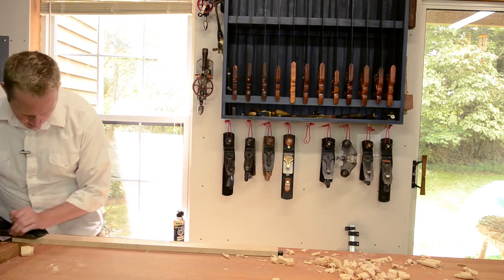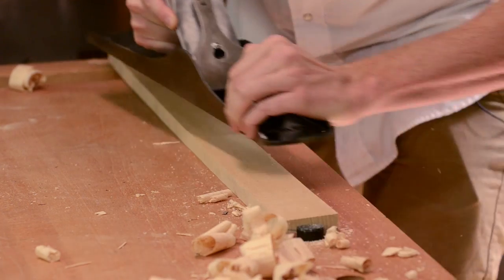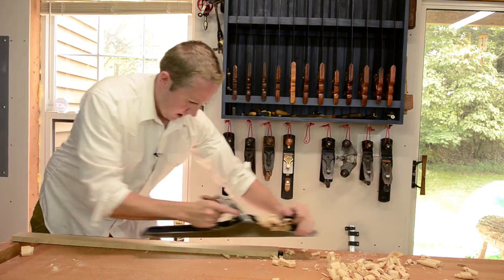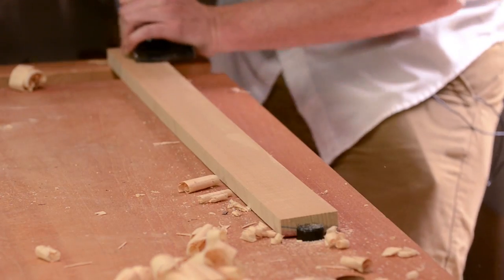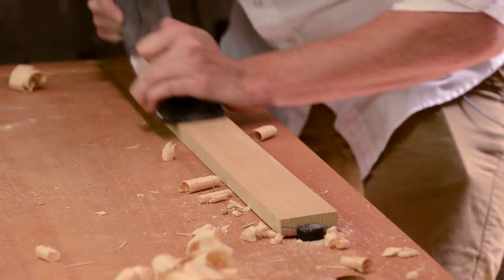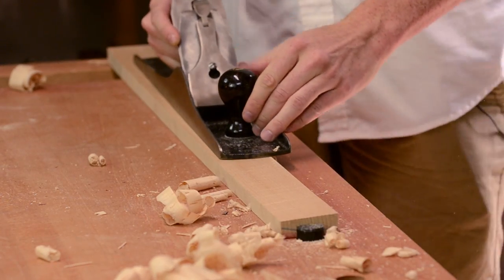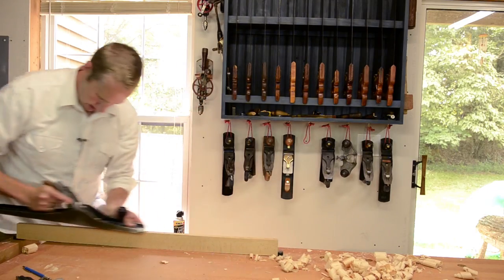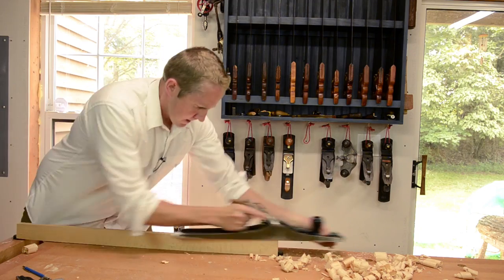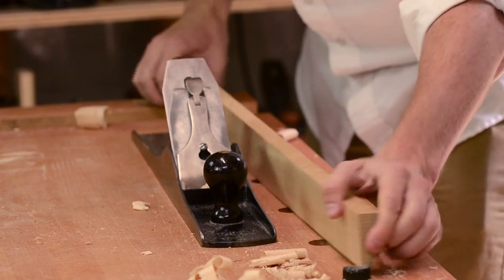What about the dimensions of the wood? I think that everybody should build theirs with hand tools — with a hand plane. You can choose your own dimensions, but I chose to make mine around 36 inches long, about 2 inches tall, and about a half inch thick for the final dimension. Make sure you plane all of the sides flat, straight, and square. If you aren't sure how to joint the edges flat, you can check out my video on how to square and dimension up boards — there's a link below this video.